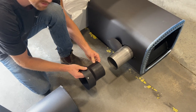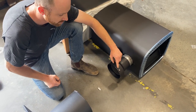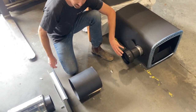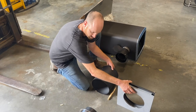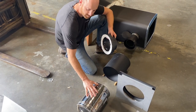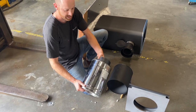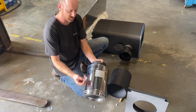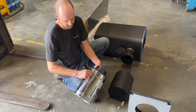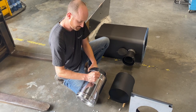The next step is your 4 to 6 inch reducer — that's going to slot right on top of that, as far as it goes. We recommend putting three screws to hold this into place. The next connection part is a 9 inch chimney piece. Every connection is going to get screwed together with your short screws. They're actually pre-drilled so you don't have to guess where to put them. You can see on all of the silver chimney parts a pre-drilled area — simply use one of the small metal screws to fasten it so it won't come apart.